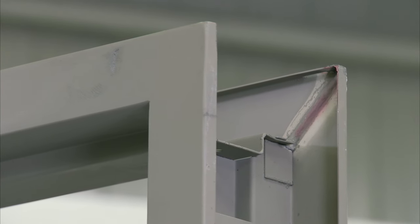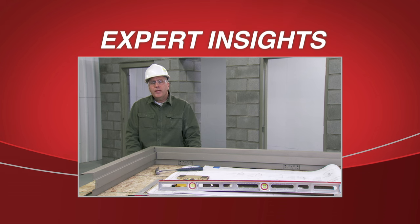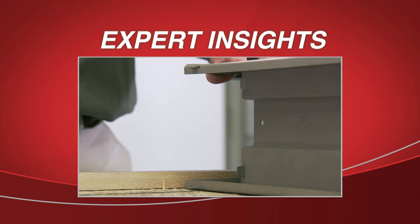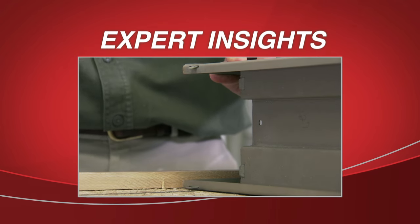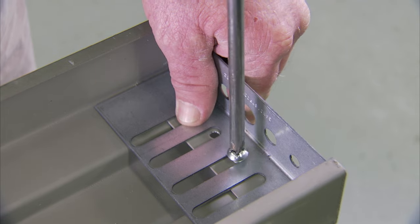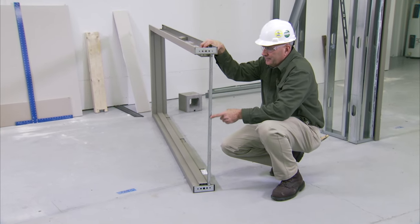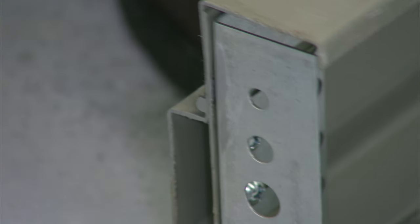The frame may be shipped already welded, or it may ship KD — knockdown. In this installation our frame is pre-welded. In a KD frame some assembly is required; it is minimal — slots and tabs go together. The most important tab connection is at the rabbited part of the frame, and those tabs should be bent in an outward position. Install base anchors to the frame using screws provided. Pre-welded frames are transported to the job site using a shipping bar to prevent the frame from twisting in transit. This bar is not to be used as a spreader bar to set the frame.